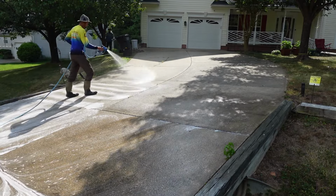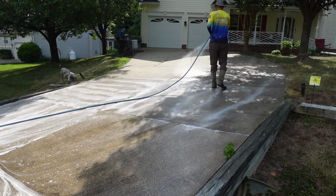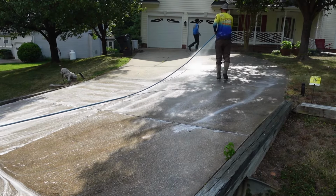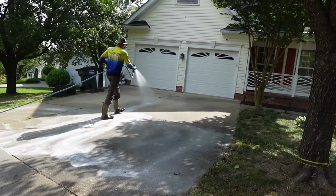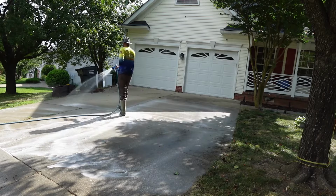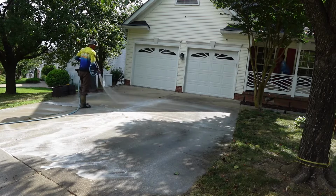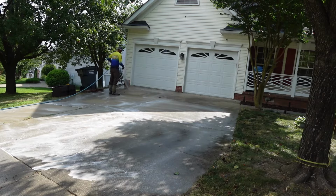Now we are pre-treating this right now with a 2.5% solution. We're actually soft washing this with our blue gun. We are using our Comet pump for that. But you know, guys, if you don't have soft washing capability, that's okay. What you're going to want to do is just put your house mix on it, your downstreaming solution. That's also going to work pretty good for you guys.